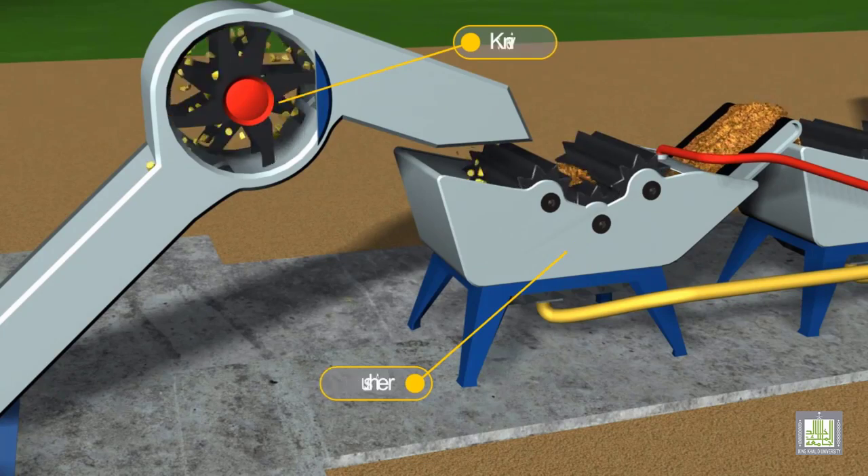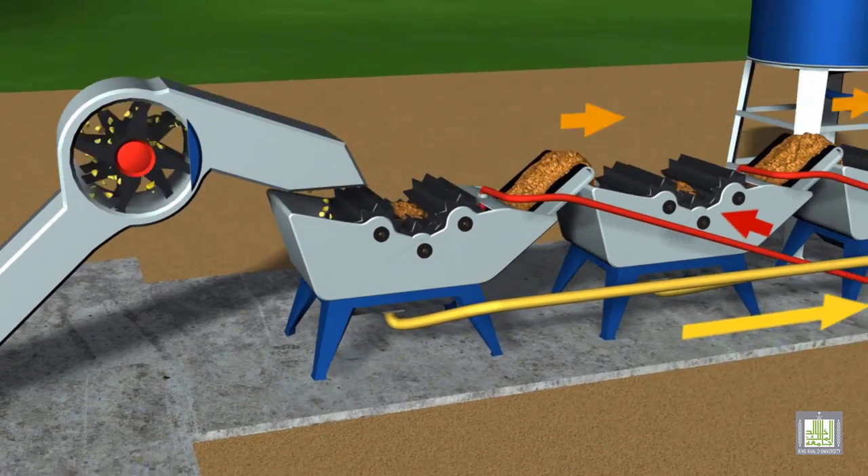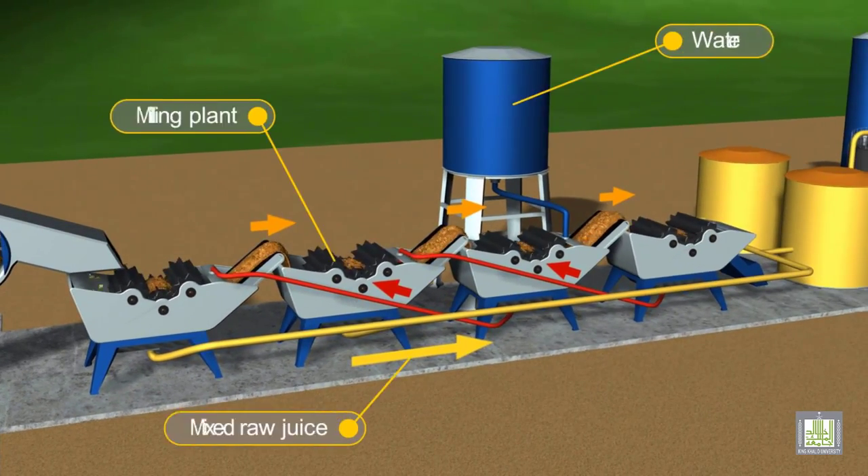This is the chopping process. After that comes the crushing of the cane, which is considered a first step towards removing the syrup from the cane. All the previous processes are applied to ease the syrup extraction process by increasing the active surface of the cane raw material.